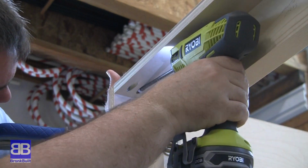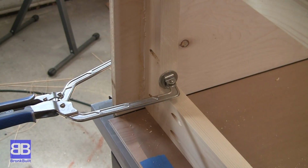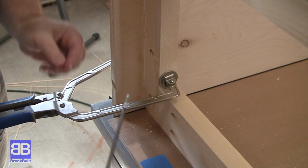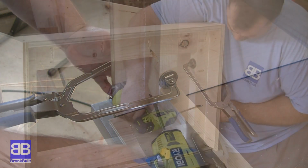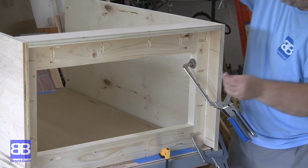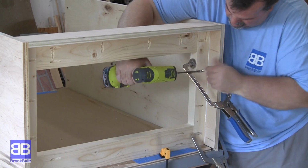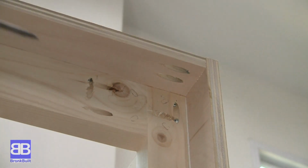You'll now see how I plan on hiding the casters. I have extended the front and sides below the 2x4 base about 3 inches. I measured the height of my casters, and by having the front and sides extend about 3 inches below, that should do a nice job in hiding the casters, yet allow them to do their job. Do this for both sides.